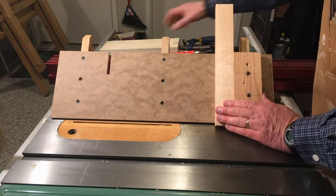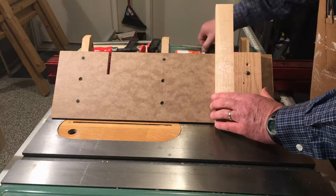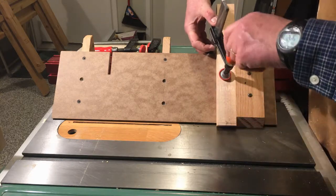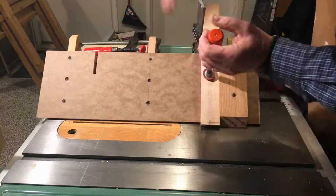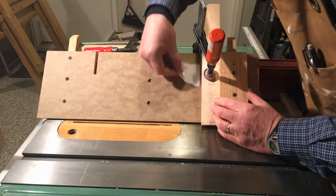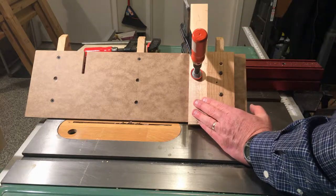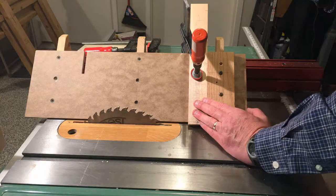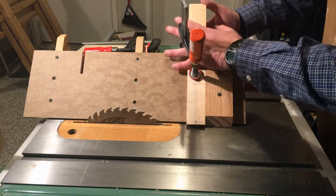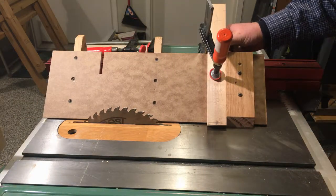I'm going to mount up our first piece of stock. Got my little clamp — there he is, buried. Let's put it in there and zip it down. We've got the workpiece setting in there tight. This is my little feeler gauge — a little piece of notebook paper. There is absolutely no gap or distortion in there; can't fit even a thin sheet of notebook paper through. We're ready to cut. Let's raise the blade — I like to keep it a little high in this case because as the teeth cut down you'll get a cleaner cut. I'll leave my pinkies well out of harm's way, left hand here, right hand there as I push through the bevel cut. Enough talking, enough jawing — let's make some sawdust.